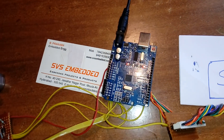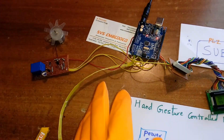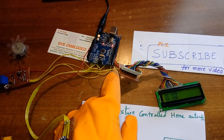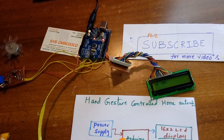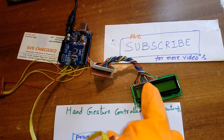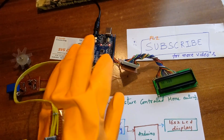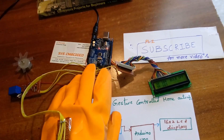On the Arduino R3 board, pins 10 and 11 are connected to the LED and fan. ADC0 and ADC1 are the analog inputs. Pins 7, 6, 5, 4, 3, and 2 are connected to the 16x2 LCD display. Whatever process is going on is displayed on the LCD. We can connect multiple options — as per this project I'm controlling only two appliances: one light and one fan, but we can control up to four appliances.